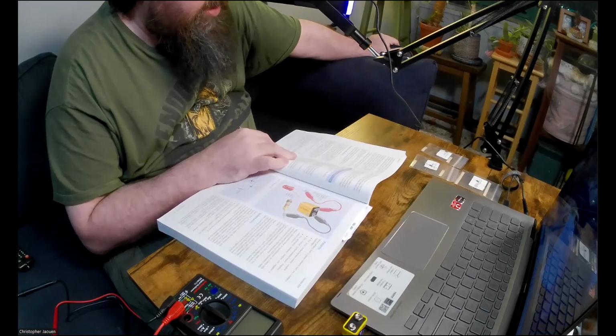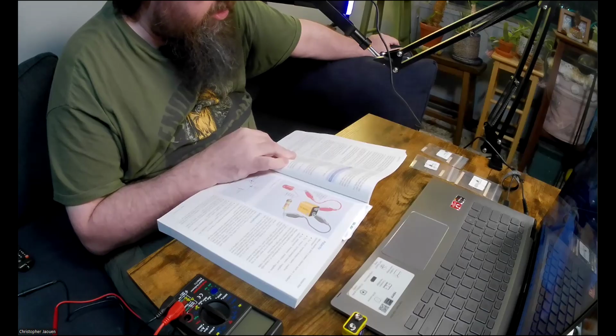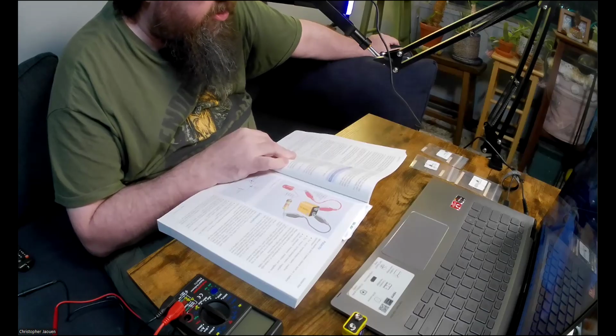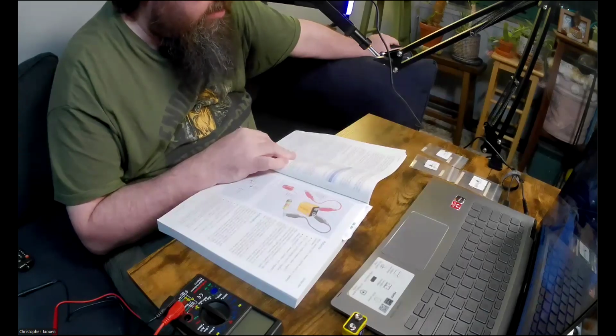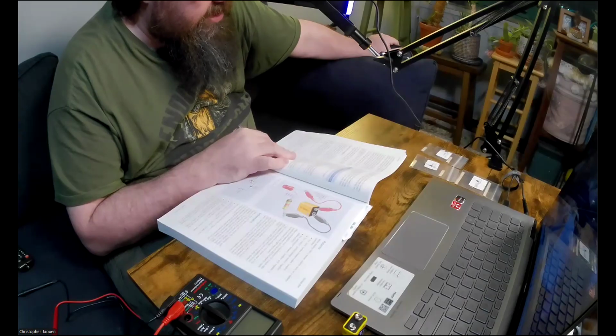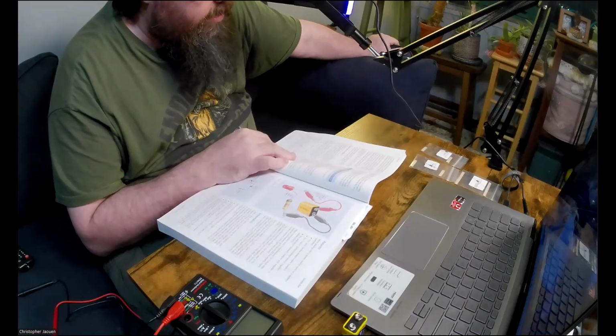At the left end of the resistor will be 3 or 4 colored stripes. If the group consists of 3 stripes, the colors of the first 2 tell you the first 2 digits in the value of the resistor. If the group consists of 4 stripes, the colors of the first 3 tell you the first 3 digits of the value of the resistor. The last stripe in the group tells you how many zeros follow the digits in the value of the resistor.